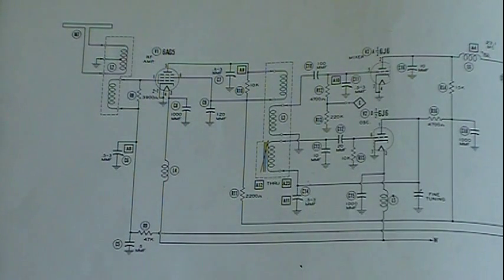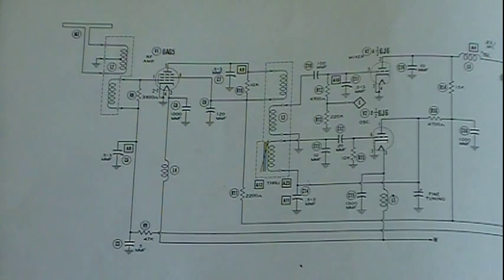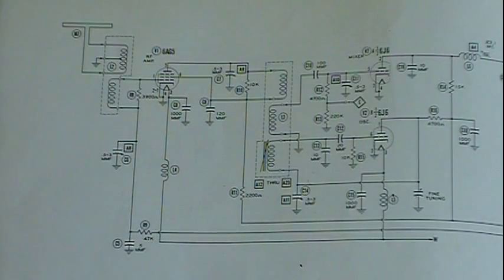The big problem with that is you're asking an amplifier to cover a large range of frequencies, the entire broadcast band. You might be able to build the amp to handle, say, the upper band really well, amplify it with good, strong gain. But when you get to the lower band, the gain drops off. Or you redesign it, and at the lower end of the band it's really strong, a lot of gain, but when you get to the upper band, it drops off. Most of them were designed where the mid band was the strongest, and they didn't drop off as much toward the upper or lower end, but you're still having this loss in gain because you're trying to build an amp and tune it across a large range of frequencies.